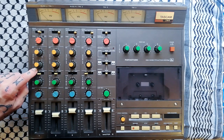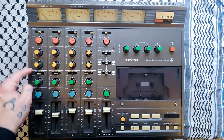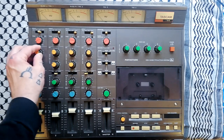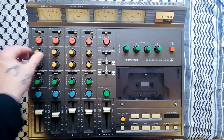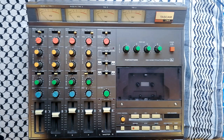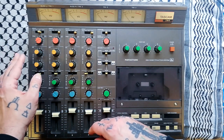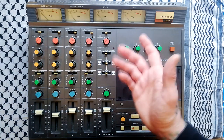The low-frequency band goes from 62 Hz — very low, close to the fundamental frequency of the low string of a bass guitar — all the way up to 1.5 kHz, right in the middle of the midrange. The high band goes from 1 kHz up to 8 kHz. The lower part of these concentric pots controls the frequency, and the top part is the gain — they just sound really great. If you're only going to have two controls, I think these are more versatile than the high/low shelving EQs in the 144, 414, or 44 Mark 1. An ideal situation would be to have two-band parametric like this plus shelving EQs — really only the Tascam 388 has that as far as I know.